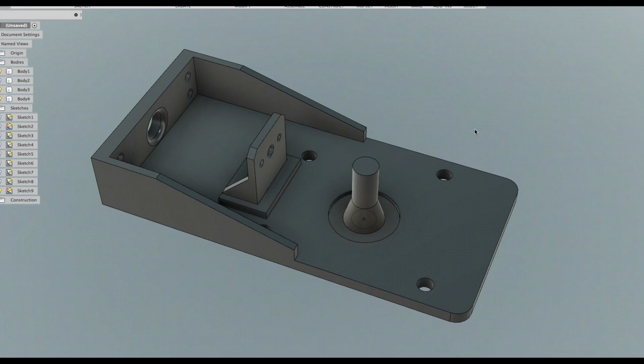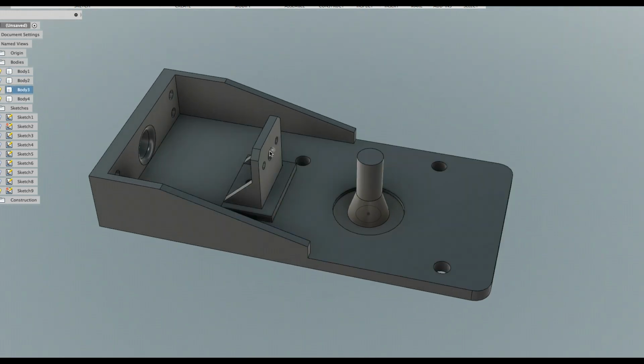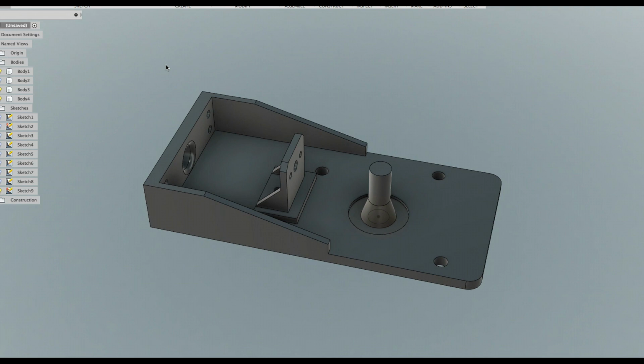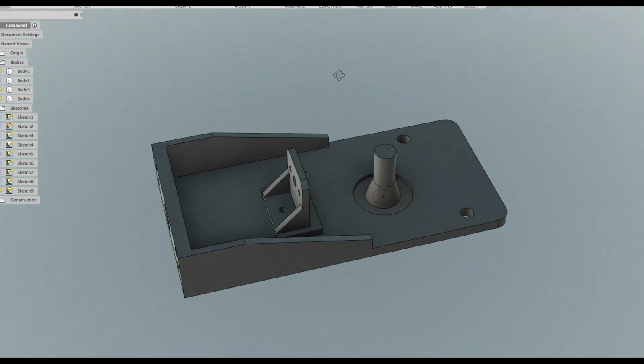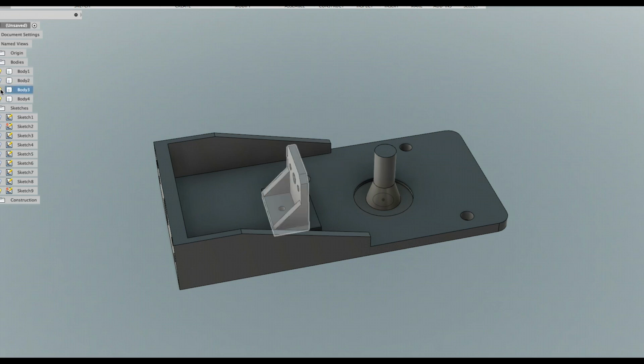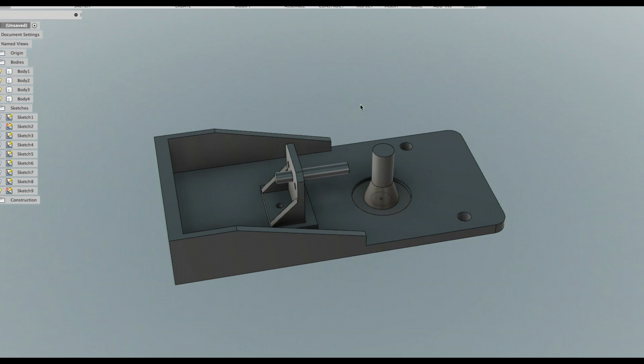Okay, so this is the design for the bracket, the right hand stick bracket that I've come up with. You can see this arrangement of holes replaces the little pylons on the original. I'm thinking I'll bolt right through rather than build little plastic towers, because there's going to be a lot of stress on those. This area here is where it'll attach to the DJI remote. This little body here, which is a separate piece and will be screwed onto the base, is for the potentiometer for tilt. That's a little shaft I'm going to have to make, which will take the tilt from the joystick and transfer it to the potentiometer from the DJI controller.